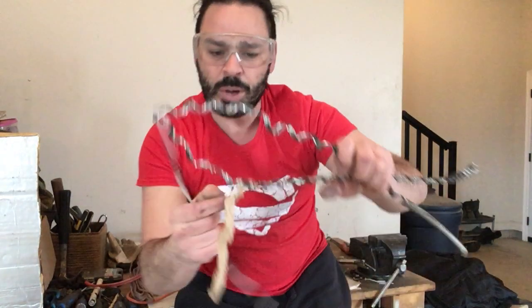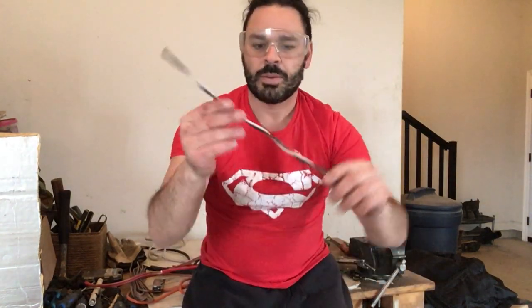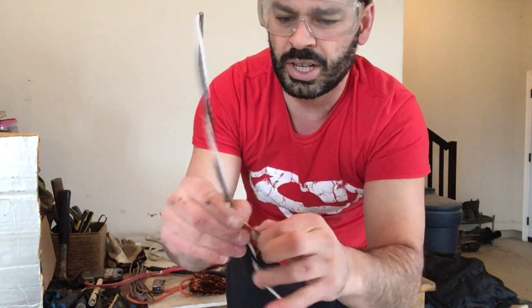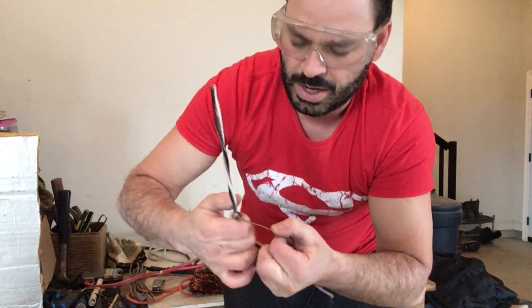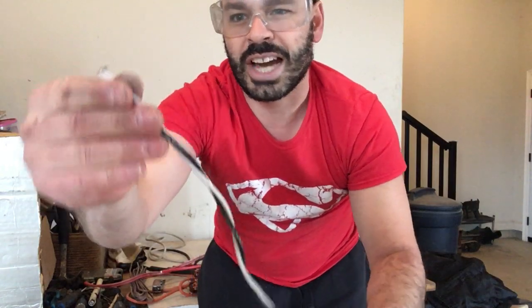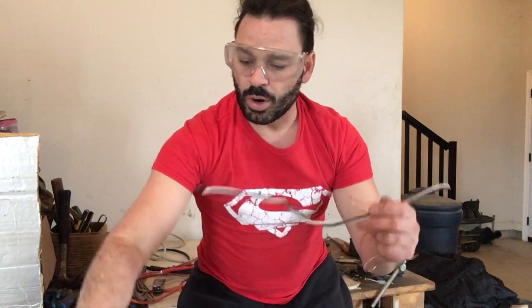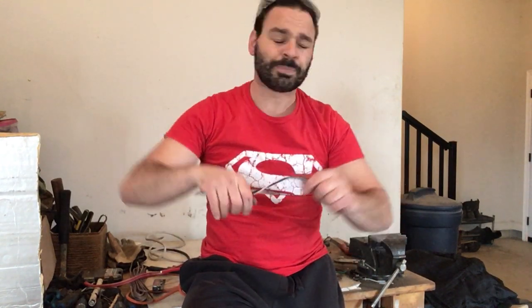Okay, so the nice thing about this now is this is going to go into my aluminum pile, so I still get money from this. But now, again, I have another really nice piece of, there's a little bit of tarnish on this. This is going to go into number one pile. And I have now the $1.93 a pound wire. Again, it's very thick gauge as well. I'm going to throw this into my stripper, and it's going to give me the number one copper price as well. Or if you have a hand stripper, because this is thicker wire, you can also use wire strippers as well. Thicker wire is easier to use with a hand stripper.